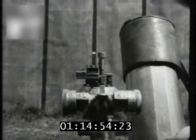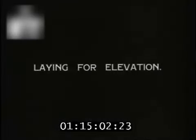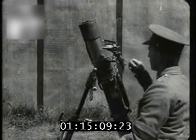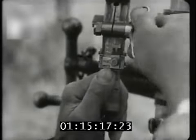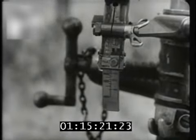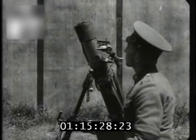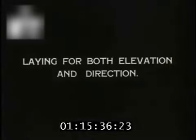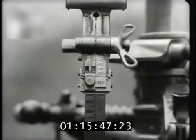If the aim is above or below the aiming mark — in this case it is below — it may be adjusted by the collimator adjusting screw. Elevation is obtained by first setting the required charge and range on the range scale: charge two, marked 'full' on the side, for example at nine hundred yards. Charge one, marked 'red' on the side, for four fifty yards.